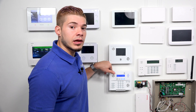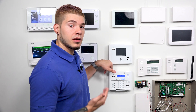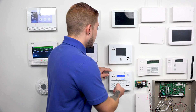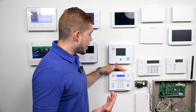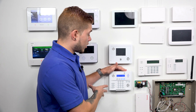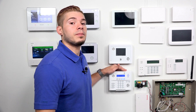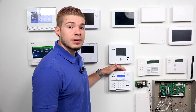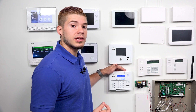After you've signed up and confirmed that the monitoring company does do phone line, you want to go ahead and wire your system up to the phone line. You're going to want to use full line seizure, which basically means if this system starts to dial out and someone's on the phone, this has priority. So once the alarm goes off and starts sending out a signal, it's going to seize the entire phone line to make sure the signal goes out. The Simon XT comes with an RJ31X jack — that's what you're going to need for the full line seizure.